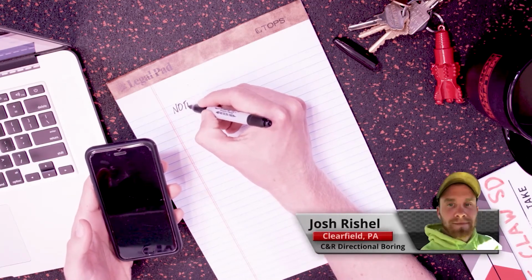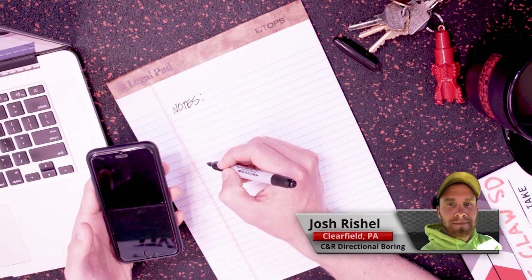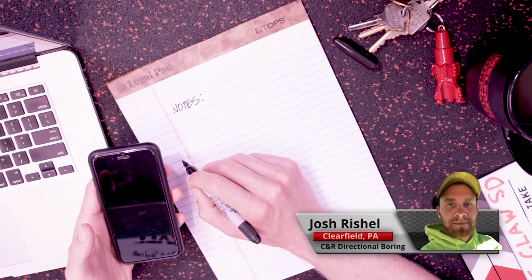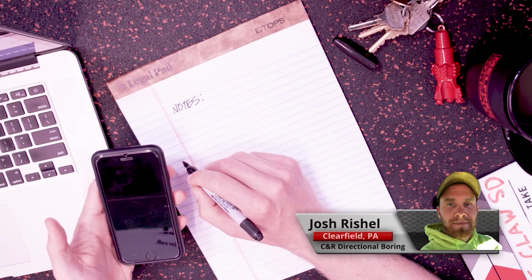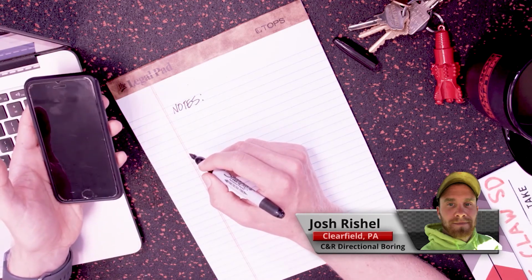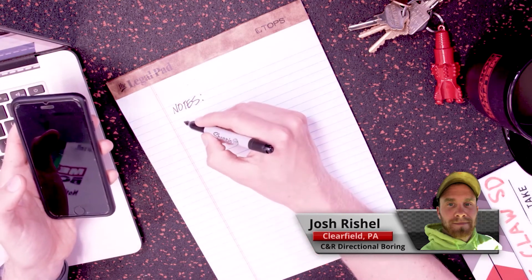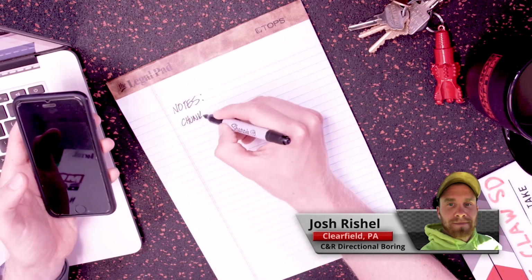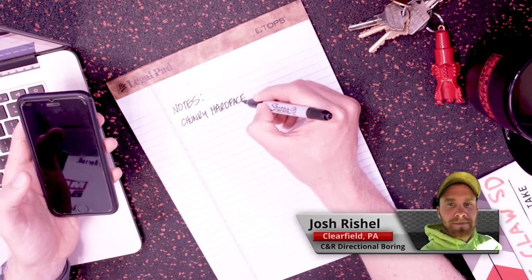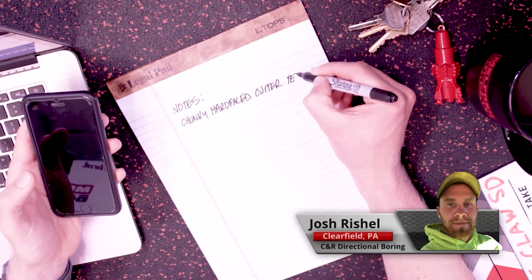It is light years better than the old style. We probably have altogether 40,000 feet on them since Steve's been getting them to us, and I don't think we've replaced the teeth in one yet. They hold up incredible. We bored a lot of stuff with that Eagle Claw that we had to hammer with PC-88 excavators to get down to. Even we have a couple 135s, Komatsus and stuff. I mean, they wouldn't even dig some of the stuff we were drilling with the Eagle Claw.